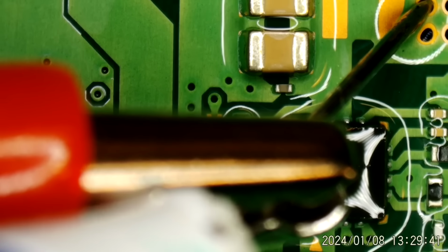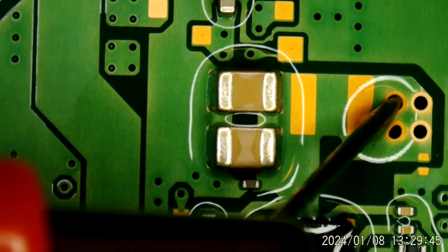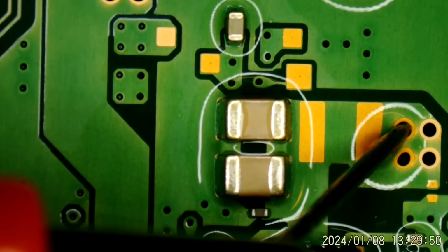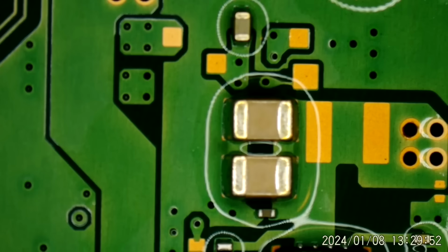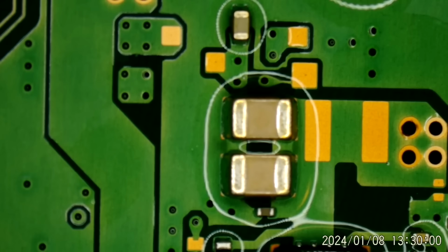That is, well, that's only 170 milliwatts. So I may have to increase my current. I mean, it's only putting out 0.18 volts, because of the current limiting. All right, let's turn this on up. Let's give it a couple of amps. Maybe it'll show itself.